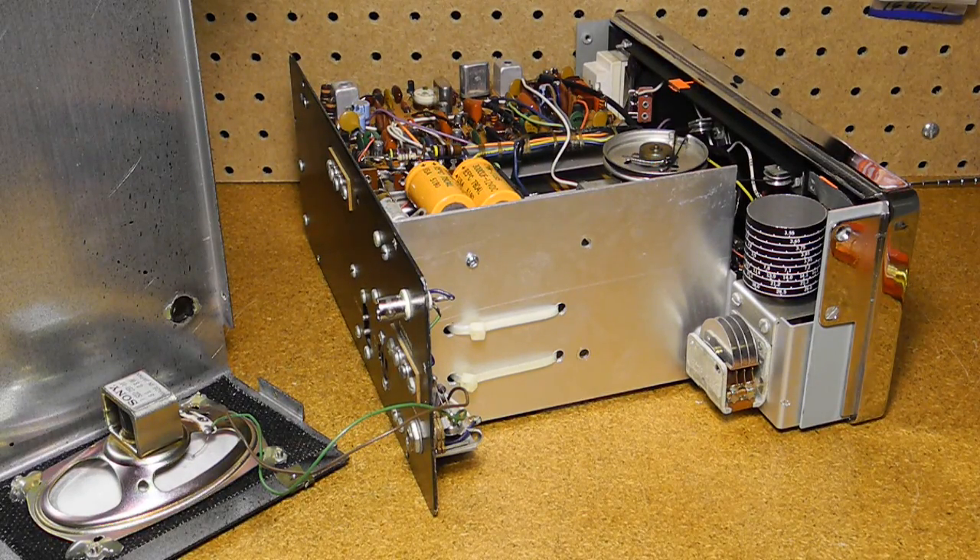On the minus side, it's a little large at 10 pounds. The NiCAD batteries in these radios had a limited life and after 40 years or so have all failed by this point. While the original battery pack is no longer obtainable, it can be replaced with eight 1.2-volt AA size NiCADs and suitable battery holders. Heathkit said the radio was suitable as a backup receiver for amateur radio use, but in practice it would be frustrating for two-way ham radio communications due to the limited accuracy of the band spread dial.